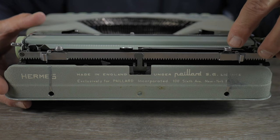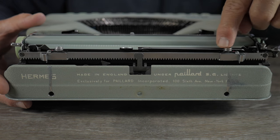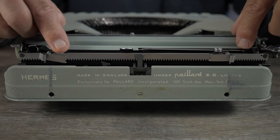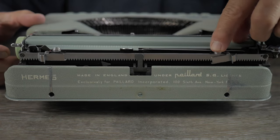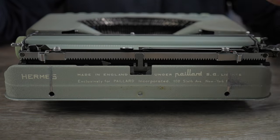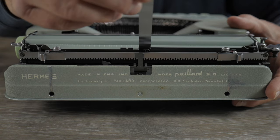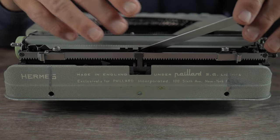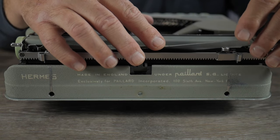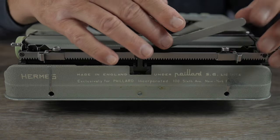On the back of the machine we see the margin settings, nicely visible from the operator's position up front. They have little round knurled knobs that you push down and slide, with a nice little red indicator for both of them marking where the margin will be set, indicating to the scale on the paper table. There's also a release switch — a little tab you push that releases the paper support arm. It's not a telescoping arm, and on this machine the arm is slightly bent, interfering with the left margin setting, so I should probably reform it a little.